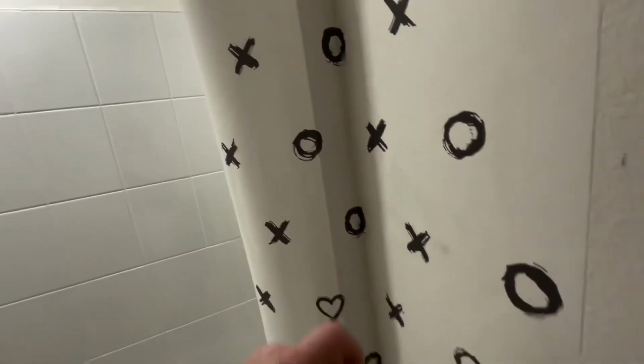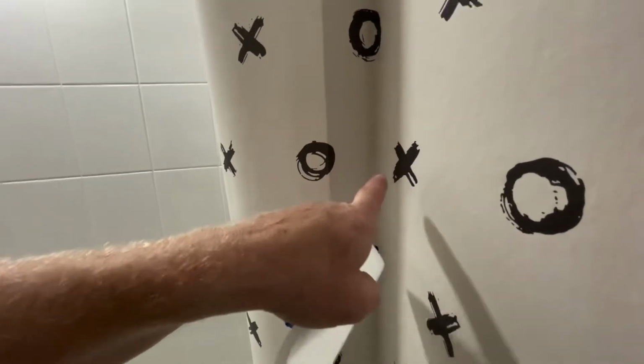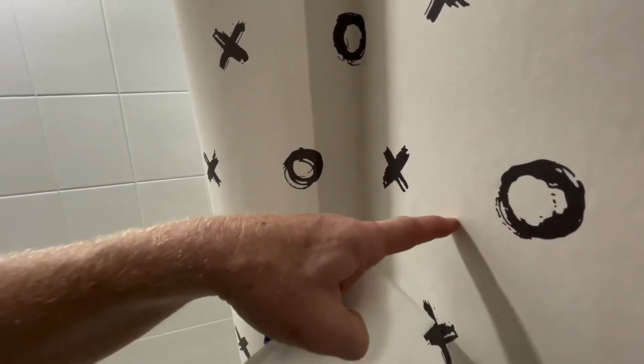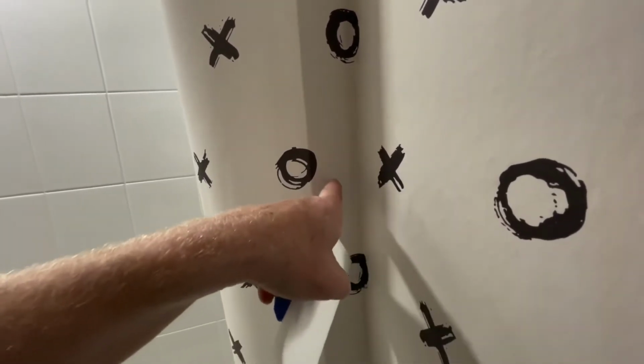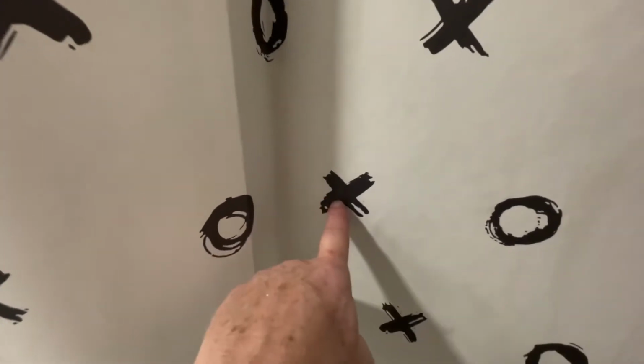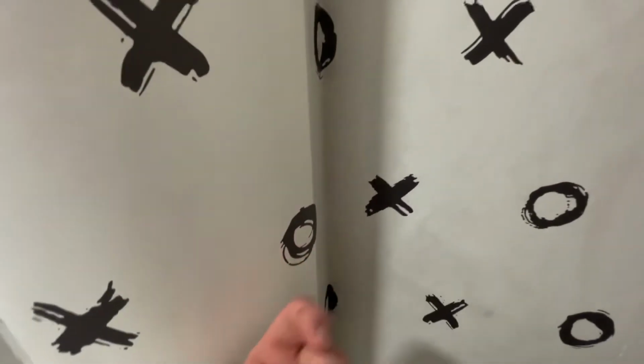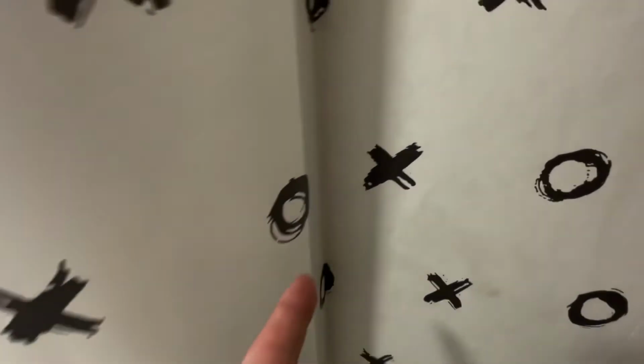That's what determines it. So I come in the bathroom, I'm looking at this wall here, and consequently this wall. Therefore, you would want this wallpaper on this wall to be underneath this. Because if you do it the other way, this wallpaper, once cut, you will see the edge looking at you when you're looking at this wall.